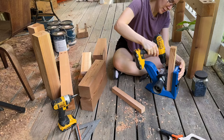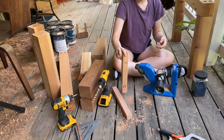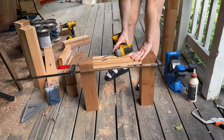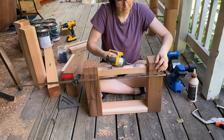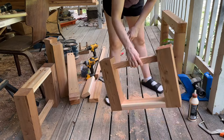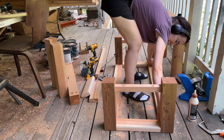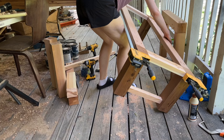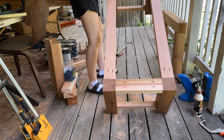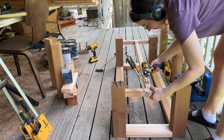The final piece of the three-piece patio set is the coffee table. Once you build even just a coffee table, it's the same general construction for larger tables too. This one uses a lot of pocket holes. You start by assembling the legs — clamps are super helpful — then get your legs lined up and add the apron pieces, which are just the long pieces that connect the legs on the sides. Remember to hide the pocket holes as much as you can; the plans do outline how to place the wood so they're always hidden. That completes the base.